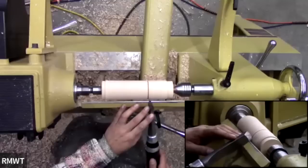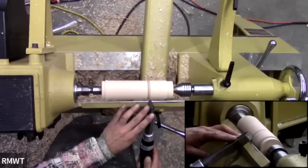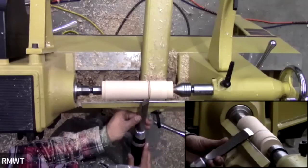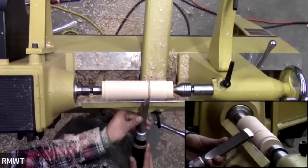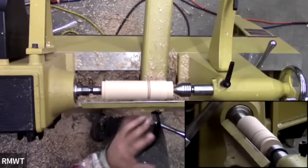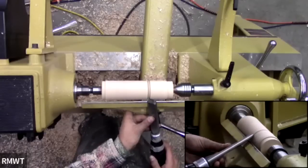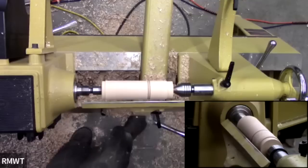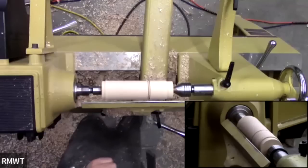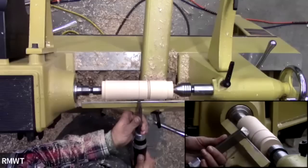One thing that can be deceiving is that if I just make a tiny little bead or tiny little V groove right here and there, it takes finesse to still make a bead like that. That's very small, but you don't have to do very much to really practice it. You want to put yourself in the line of fire, not figuratively, not literally. But what you want to do is, if I'm making little cuts like that, it's very easy to think that I'm a master bead roller now, maybe, but try something a little bit more difficult. Try something where you're actually leading with the long point.